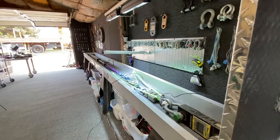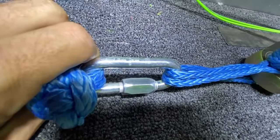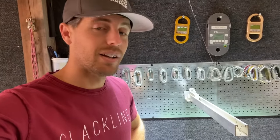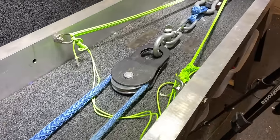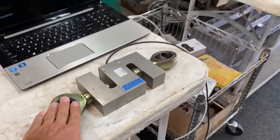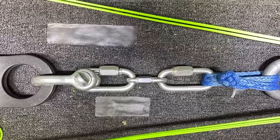You can see it just gradually went up and then plateaued at 48.8 because my hydraulic doesn't go above 48. So if the thing is rated for 25, that's crazy. Good news and bad news — I'll throw my 2-to-1 on here so we can really break this thing. Bad news: I don't think I'm going to be breaking this steel quick link. It's connected via a span set to a big fat Amsteel sling which goes through a pulley and back to the hydraulic for a 2-to-1. I took it out of the load cell system and double-wrapped because when you start dealing with forces this high, things get scary.